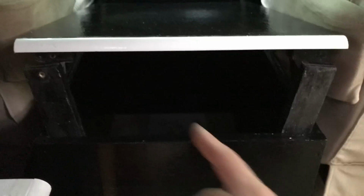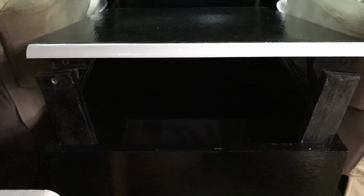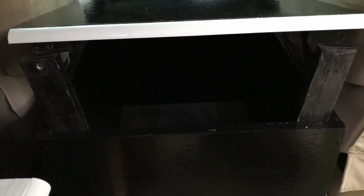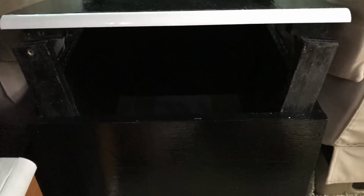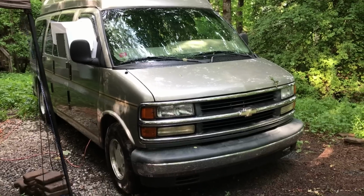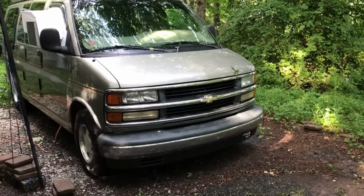It also makes a seat. But what I found out was, in order to get it quiet enough, I was going to have to put a lot of sound deadening insulation in there. And by the time I put enough insulation in to make any difference in sound, the box was too small inside and prone to overheating. That was disappointing, but I used my decibel meter and did some testing. The box without the insulation only dropped the decibels about maybe 2.